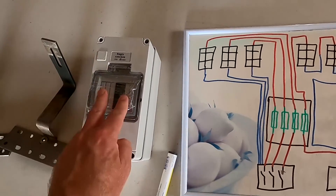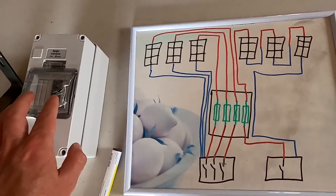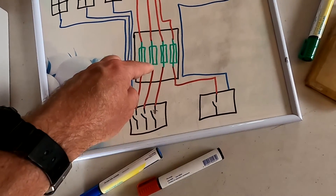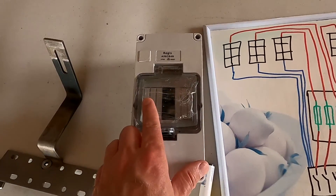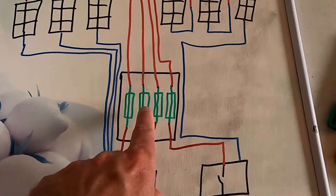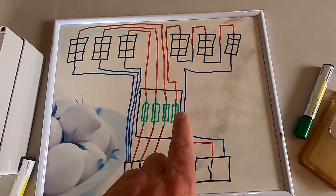The parallel panels will have a maximum voltage of only 33 volts, which is still considered a low voltage, but 110 volts DC — be careful. I would like to have these fuses as close as possible to the solar panels so the fuse inside the box protects my cabling as well. From a safety perspective, I bought this weatherproof enclosure for four fuse holders — three for the parallel connection and one for the series connection. The fuse holders haven't arrived yet but should be very soon.